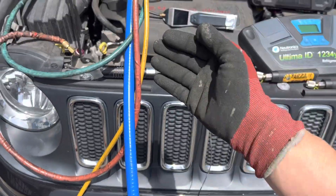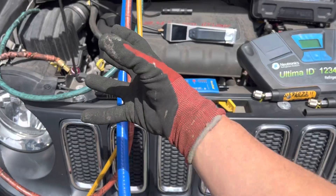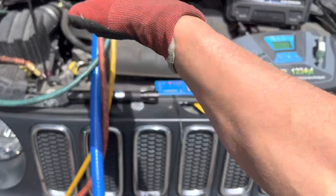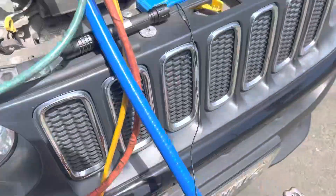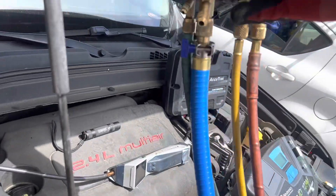If there is a leak, this thing has been respirating to the atmosphere through the leak every time the engine heats up and cools down — it draws outside moist ambient air in, heats up, pushes it out through that hole, and keeps doing that. So let's give it a little pressure. It'd help if I opened up one valve — let's close the vacuum because we don't want to blow 170 PSI into my vacuum pump, because there will be an oily mess everywhere.